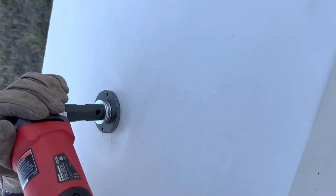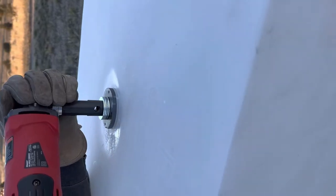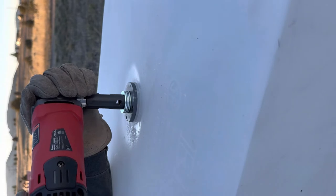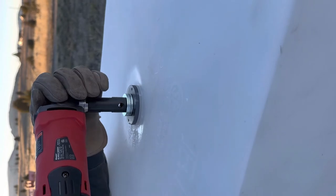The theory is you're supposed to have it in there with a nice snug fit, put a little bit of medium pressure down on it, and spin it until the plastic kind of becomes molten — then not go too far because it'll just make the hole bigger and push it into the tank. But here goes, just make sure it's flat.